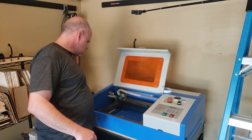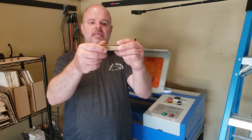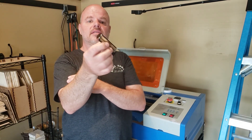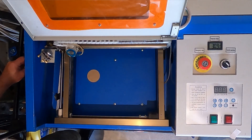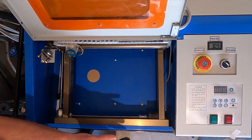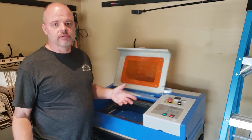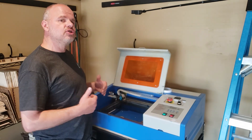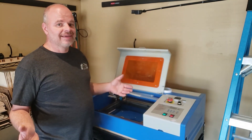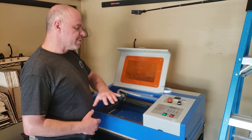The main bed is supported on something like this — it's the same thing, but it's got neodymium magnets on top and bottom so that they stick to the sheet metal in the bottom of your laser. When you look inside my laser, you're going to see that I've removed everything. The bed that comes on the machine is totally useless. I'm not even sure why they bother to manufacture it, because it doesn't do anything that anybody I know of in the U.S. is actually using it to do. So just remove all of it.